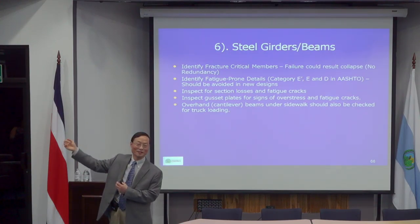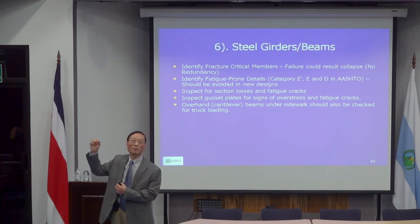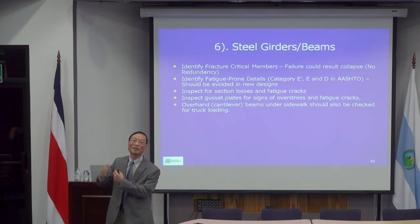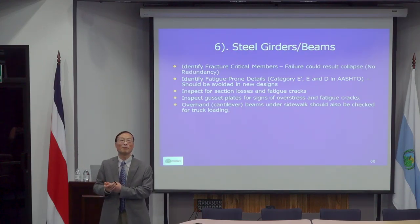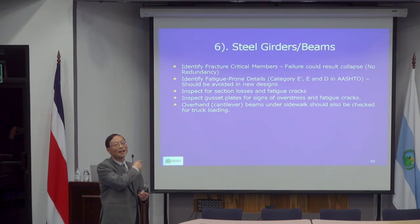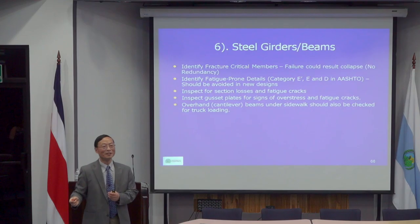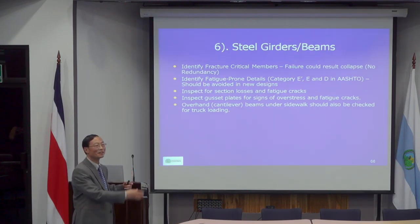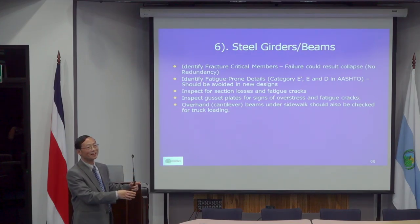Of course, you could apply, which is typical, a bonding agent. A bonding agent is basically just a paste of epoxy that will give you much better bonding. The real problem is corrosion, especially for decks; for other elements it may be fine. Because in a deck, there's a lot of corrosive material, typically chloride, because people use a lot of salt on the existing concrete deck.